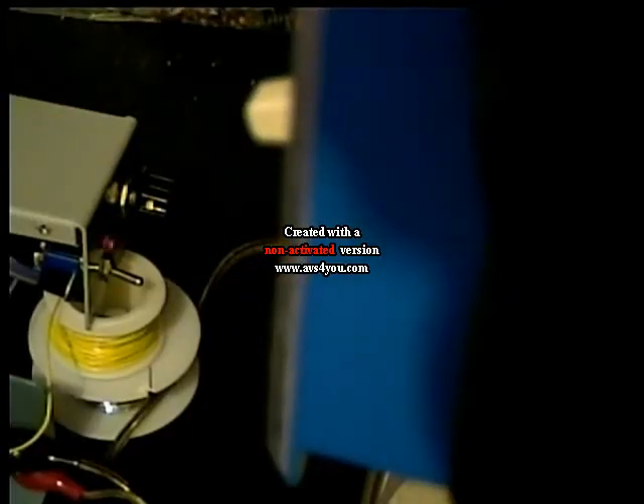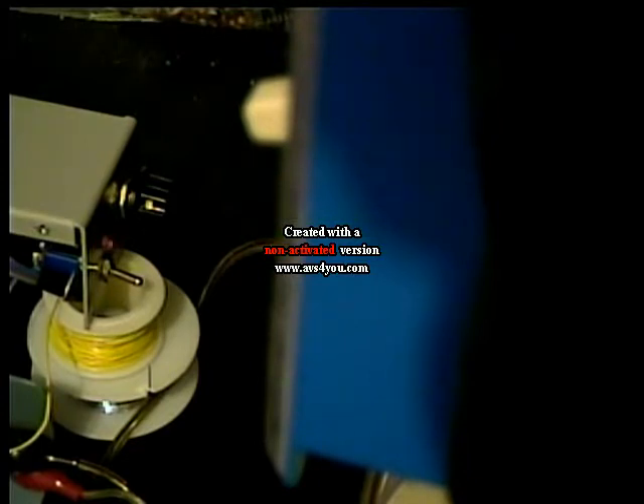There's the peak indicator. There's also a manual gain control on the back panel, which adjusts the first amplifier's gain anywhere from unity to 100 times voltage gain. That lets me set the gain just high enough to bring peaks into the ALC range without overloading the unit. The unit turned out to be pretty resistant to overload anyway, so I've got delightfully good sound quality.